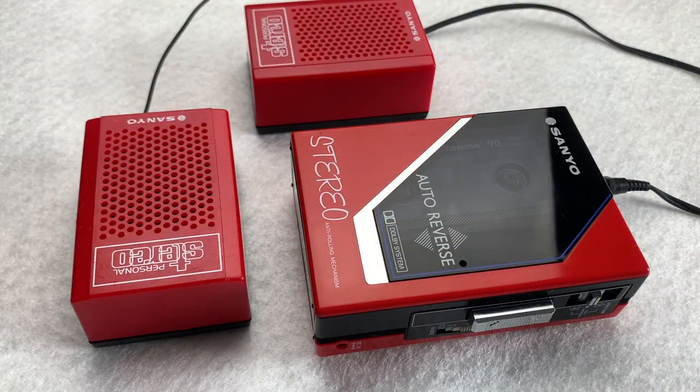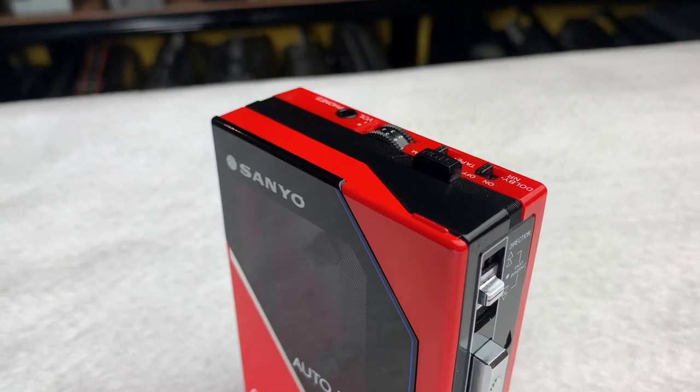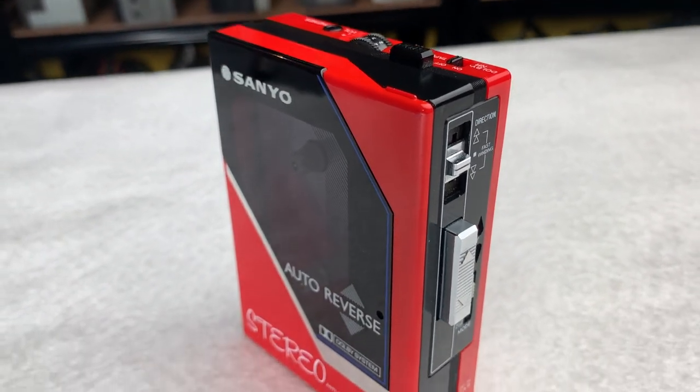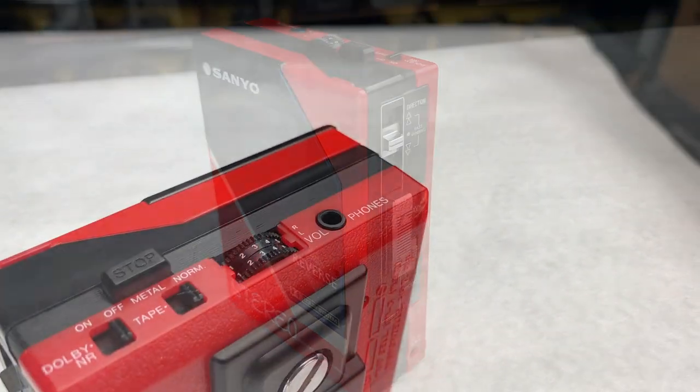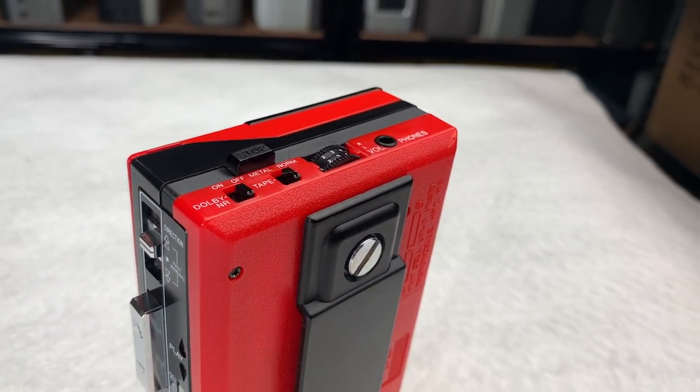It just needed a bit of a clean and a polish really. So when we've done that, clean the head and the pinch rollers and capstans as well. And the main thing really was to change the belt. Now, it wasn't too bad in the end. I think we had to, what, desolder four little wires off the back of the board or something like that.